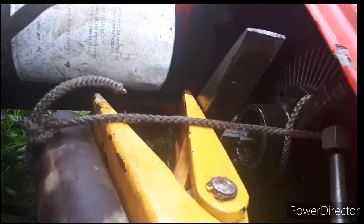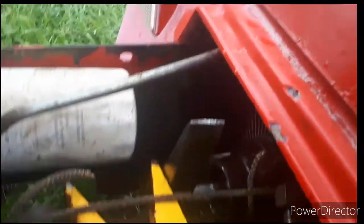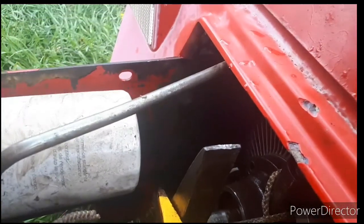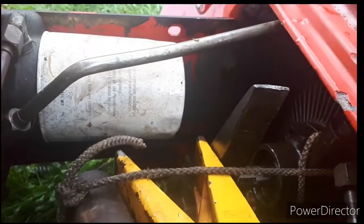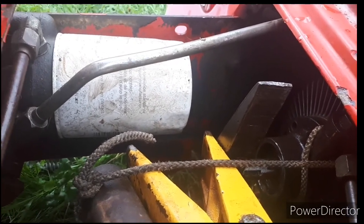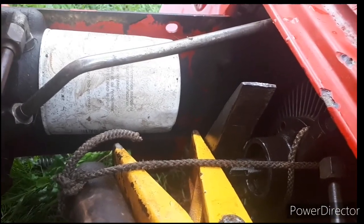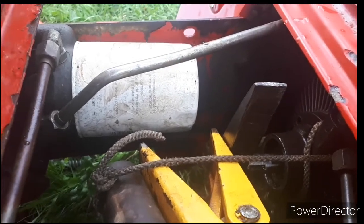And looking in the parts manual last night again, the kit for rebuilding this comes with the housing and the oil seal that's behind the bearing. And it comes with the Lovejoy type rubber, like a Lovejoy spline connector that's got like a rubber thing. I don't know whether this is rubber or whether it's a nylon or what it is, but it looks exactly like the center guts out of a Lovejoy coupling, a star-shaped thing that's got like six fingers or something like that on it.